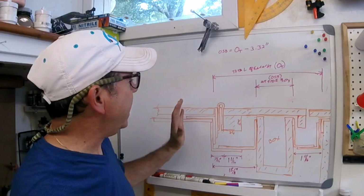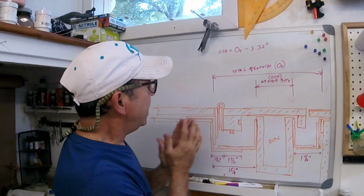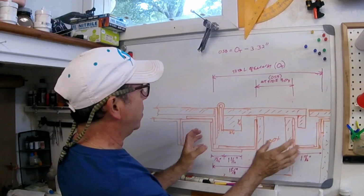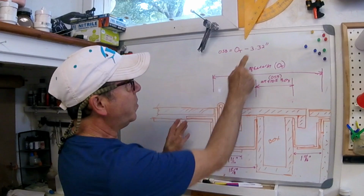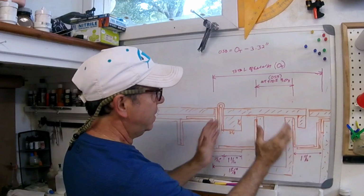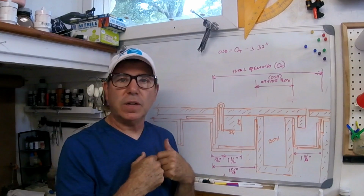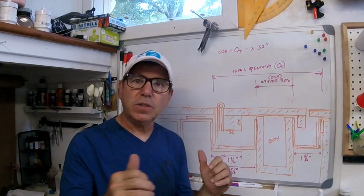So what comes into play is the dimensions of all these pieces of aluminum, and just calculating out what gets used up by the framing for a watertight compartment. You'll lose somewhere between 3 and 3.32 inches, which is the maximum I figured here, to your box. So the lesson learned is that you really can't just design and go. You've got to put a few frames up and make some additional measurements.